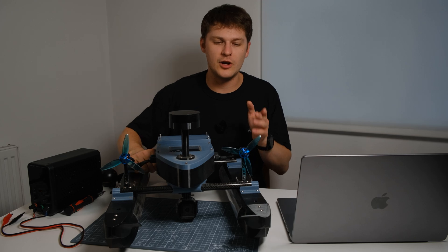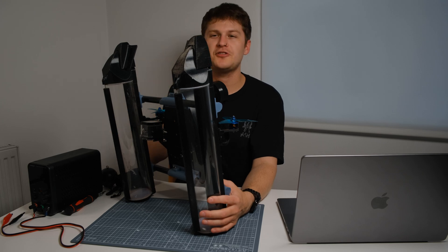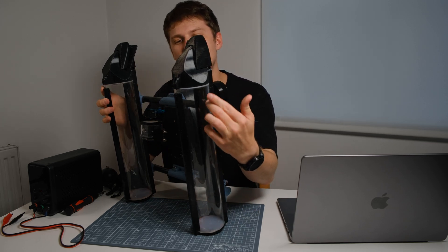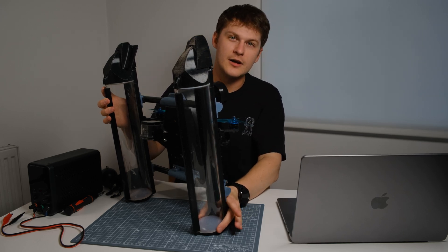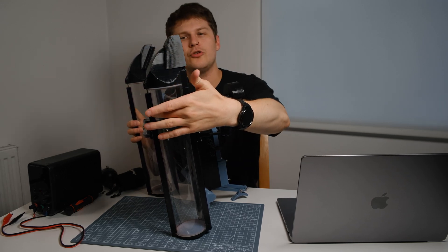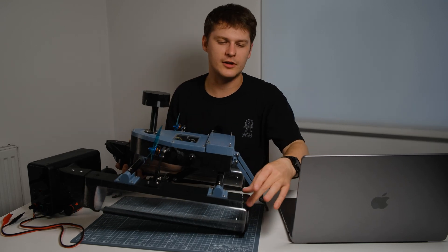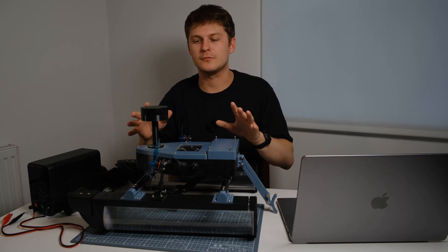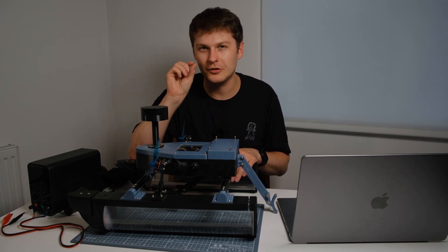The hulls are designed from acrylic tubes. As nice as I think they look, they're not very practical. You've got air inside the tube and two silicon rubber discs at each end. We then have an end cap, two bars at the bottom and top, and a cap on the other side too. As you tighten the screws down you clamp the rubber.